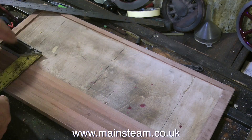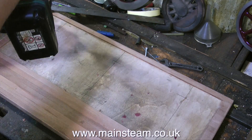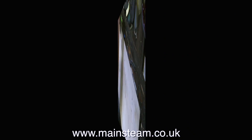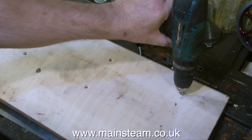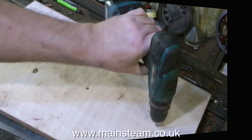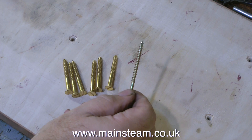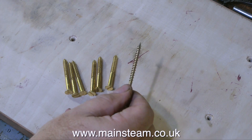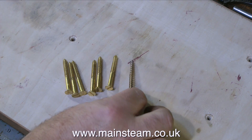What I'm doing at the moment is marking out to drill six holes in the base to allow me to screw this base to the main mounting plinth, the one with the bricks on it. This is the underside of the board and I'm using a countersink in the drill to countersink the holes. I'm going to use some brass screws to fasten these parts together — even though they're not going to be seen underneath the baseboard, I can be assured they're never going to go rusty. I'll probably use one of these cutter screws to drill a pilot hole first.